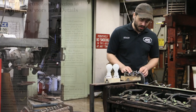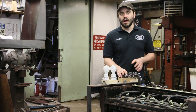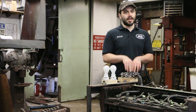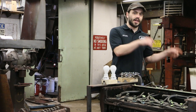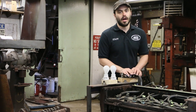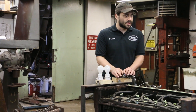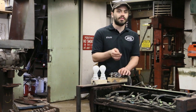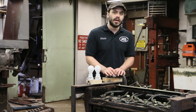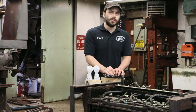This is all set up and wired similar to how it would be under the car — the resistors are connected the same way traction resistors would be, and the light bulbs are connected where the motors would be coming out of the controller. That allows us to not only step through all positions on the controller and verify everything's working, but also to demonstrate how the control system actually works and what it's doing to the motors.